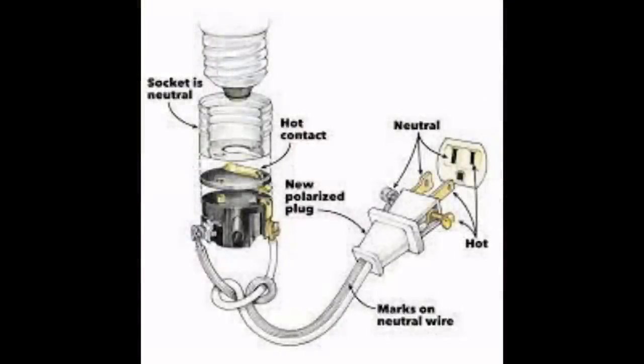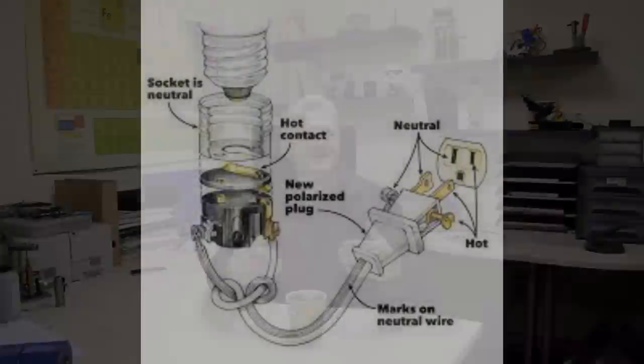It controls itself, because we have set the resistance at 920 ohms. It can't do anything else. And so a quarter of an amp, it isn't going to flip your breaker, because it can't. There is no other control needed for a light bulb than that. And a light bulb, of course, is just a heater. And if you take apart a lamp, what you'll see is the wires going in to the little prongs and nothing else, because that's all you need.